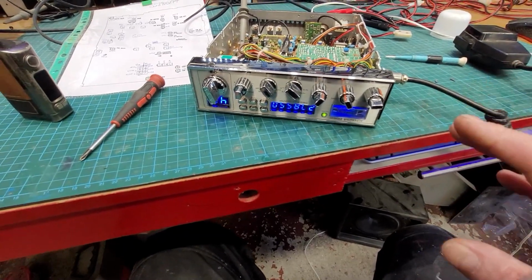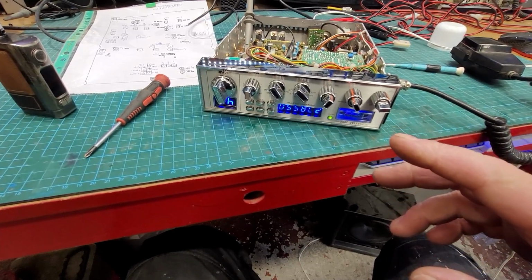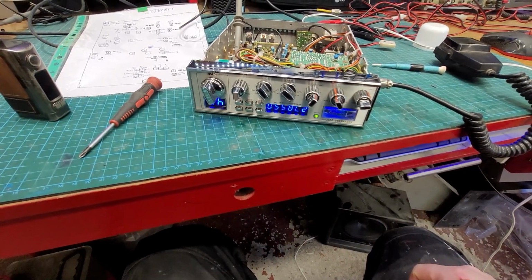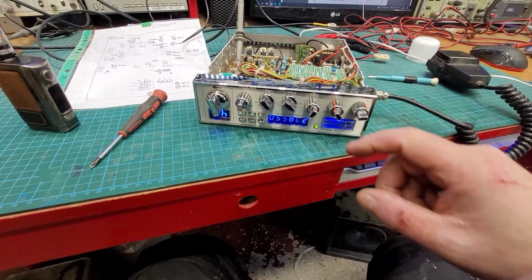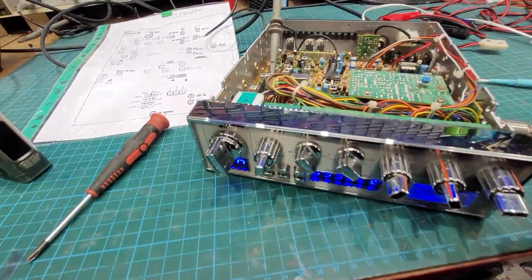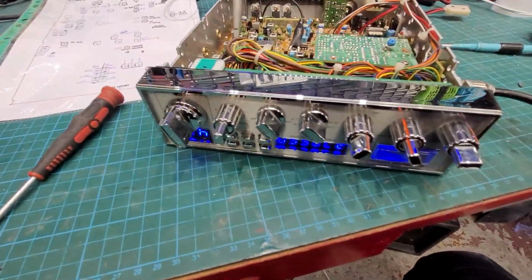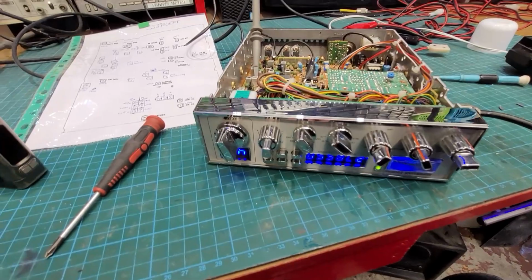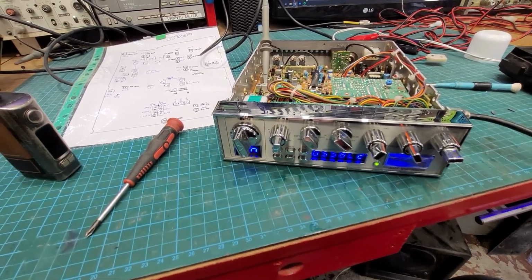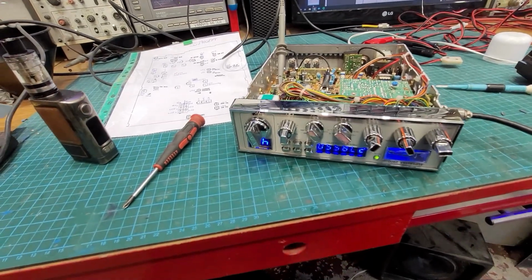It's quite widespread on these radios, so occasionally I'll show you at the end, when we're going through all the different bands and stuff, that you have to bump the... See, this is a notched clarifier, and the way it's done, you can't denotch these. I tried it on the last one, and ended up making balls of it, so I ended up putting a 10-turn clarifier in it.